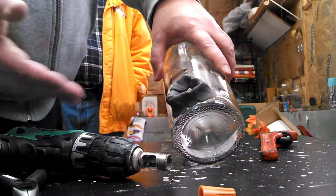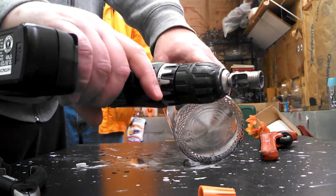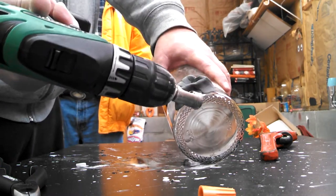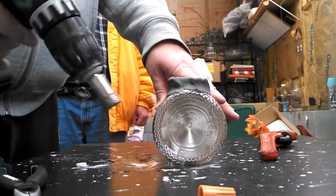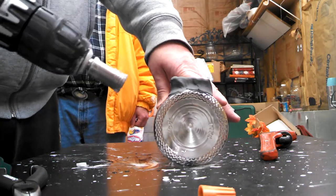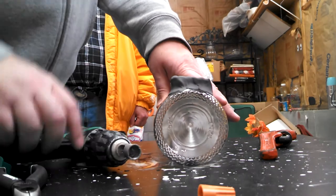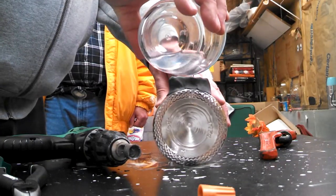Since I've been using a drill for a very long time and drilled many holes in my life, I have a pretty steady hand. Since this is glass and this is a diamond bit, it creates a lot of friction — glass is made out of sand and some other compounds. The water I'm going to pour in here now is going to cool that off, because you want your drill bit at a very high speed but a very slow pace.